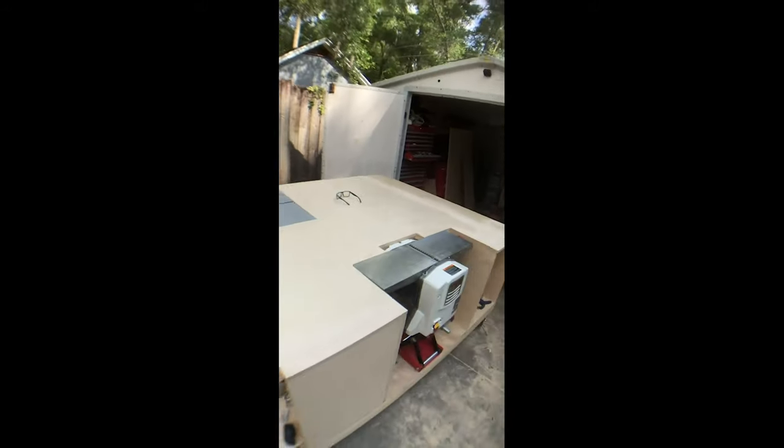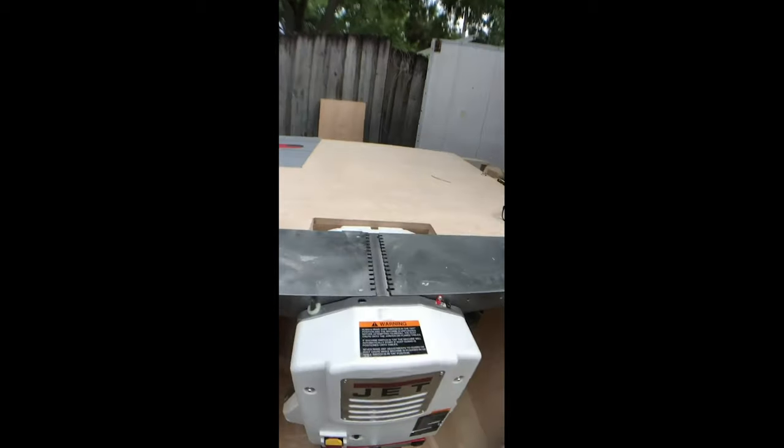Top is on, everything is cut out. I thought the motorcycle jack was a good idea, but it's a little wobbly, so I don't want it actually sitting on the jack. I'm going to put it on a platform and make two stops — one that keeps the joiner bed level with the top, and another that keeps the planer level with the top. The jack is just going to be used to bring them between those two stops. So it's not really sitting on it, it's just for adjusting the level. Maybe that'll work.